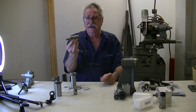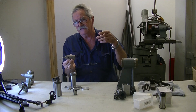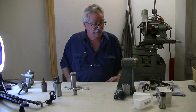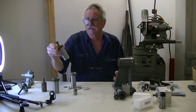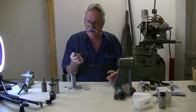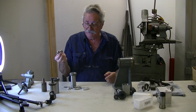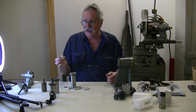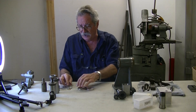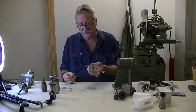Tool and cutter accessories. Extension shaft for the Clarkson — half inch BSF left-hand at both ends. That gets the wheel outside of the wheel guard envelope, which is worse luck, but it gives you a bit more reach. While scratching around in the box of goodies there are also bushes and things — a one-inch arbor for holding saw blades etc. The Clarkson runs on plain bushes, not collets, and you have a grub screw that comes through from the outside of the holder onto the shank. I've got a set of these in metric and imperial. You'll find you'll be making a lot of little bushings so that you can use larger wheels with a small half-inch shaft.